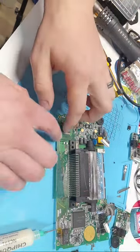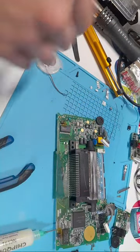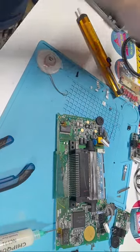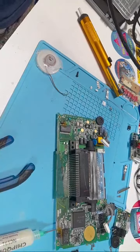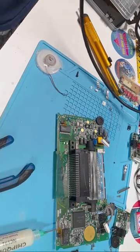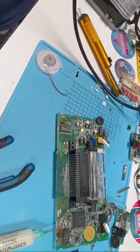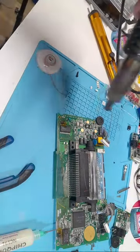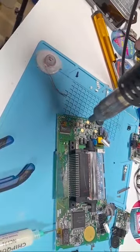Alrighty, so that capacitor's off. Now, this is gonna be a little noisy, I apologize, but this is the easiest way to pop off capacitors. This was taught to me by Retro6. He did a video on it. So, apologize, the beeps are kind of obnoxious. So, I'm gonna put my heat to 380. And I'm just gonna kind of gently heat up my board here a little bit. Make sure I'm not missing any more comments. Yeah, it doesn't refresh, that's why.